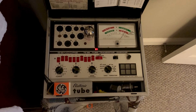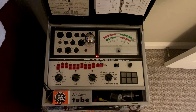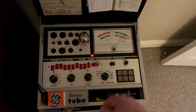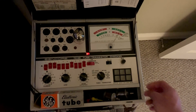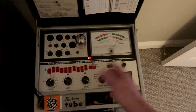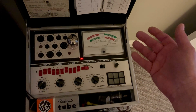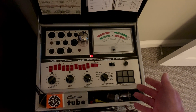I think I found maybe a couple of 6LF6s that are still good, and I'm going to check those next. I've got four more here that I'm checking — I want to weed out any bad ones. But this is a really nice tester. It's in pretty good shape, it's all original. When I get a chance, I'm going to pull it out of here and change whatever electrolytic capacitors are in it. It looks like nobody had ever touched it, so it's still an original tester.